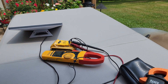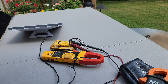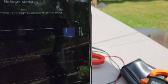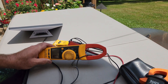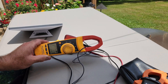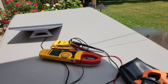I know I read something about 25W being the expected normal usage, but we'll see. It is loaded and connected, everything's booted up. It just found satellites — it's still working on that — but it's dropped down to 1.1 amps, 1 amp, flickering back and forth at 19.4V. So that's about 20W. Once it's booted up and everything's running, it settles down to about 20W.